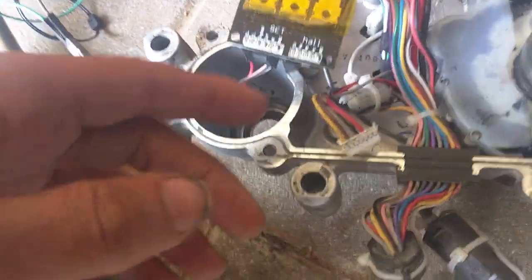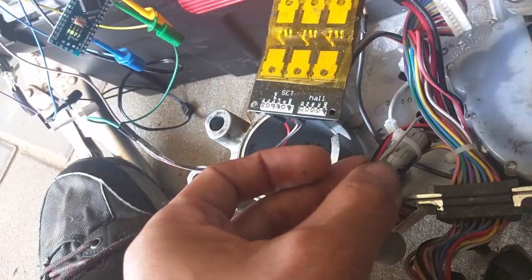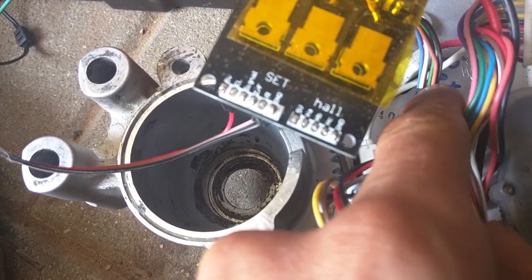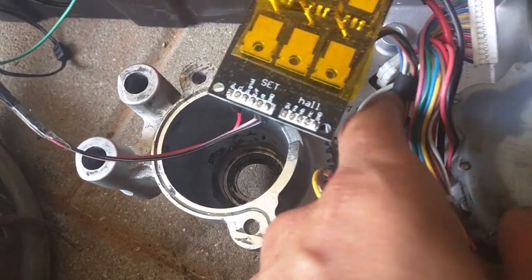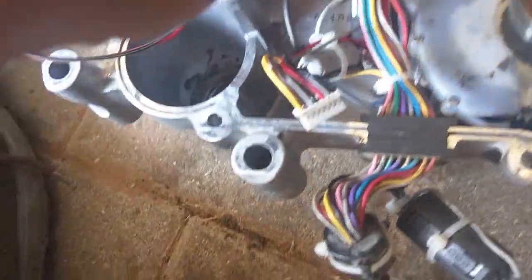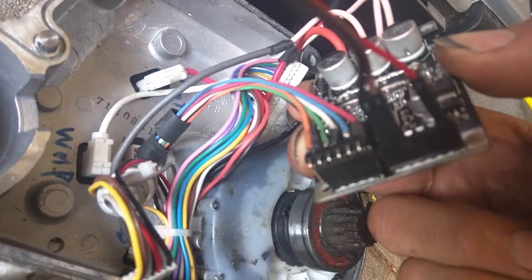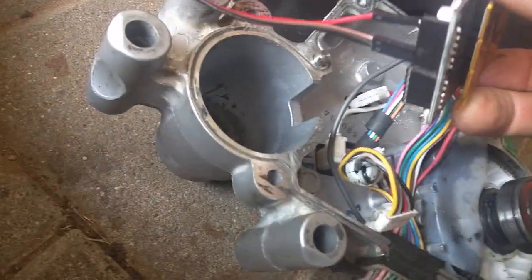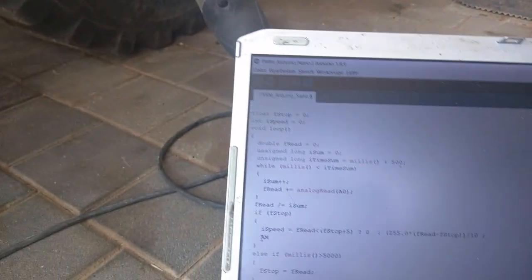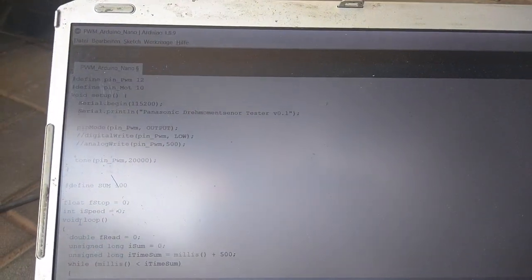The Hall sensors — there's an orange cable and then blue, white, and green for A, B, C. You just have to check it out. You can see here: blue is A, white is B, and green is C.